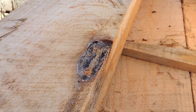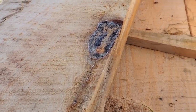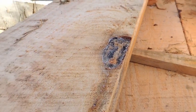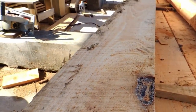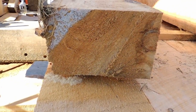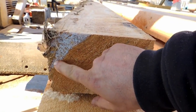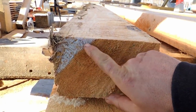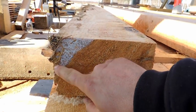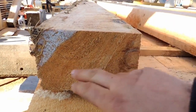We're walking around the pile showing some bark inclusions. You can see where that piece right there could be an issue — see how it splits off. Now, where that's located on this particular timber isn't too bad. Notice where that heartwood is — it's up to the upper left-hand corner, and the sapwood's pretty close there. The way those rings are positioned makes this a really good example of an unstable timber.